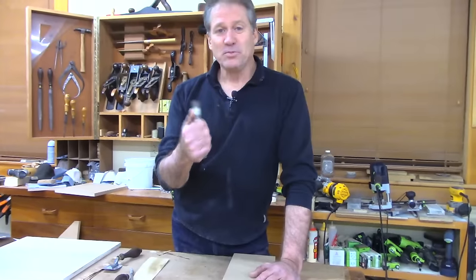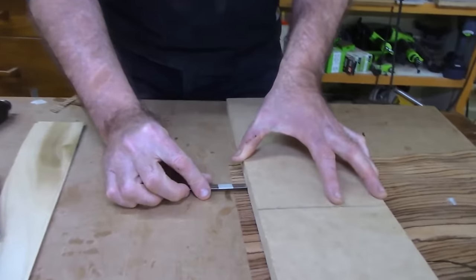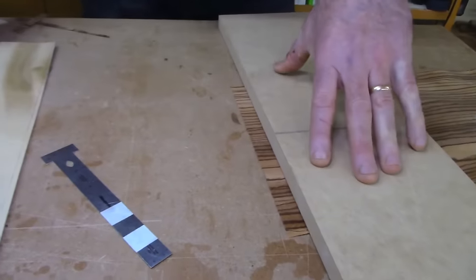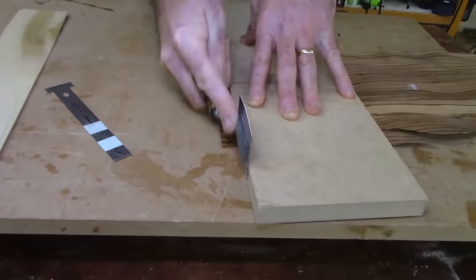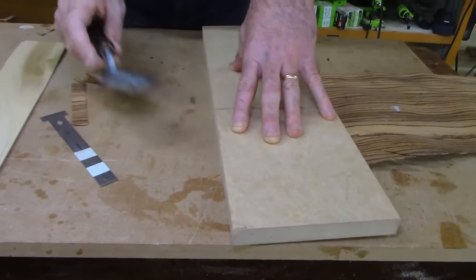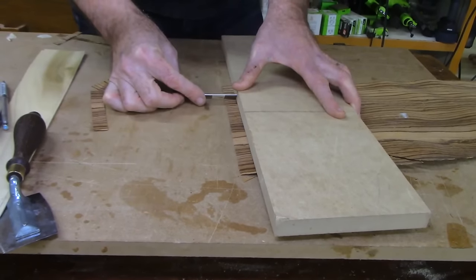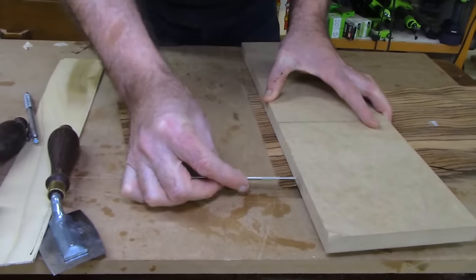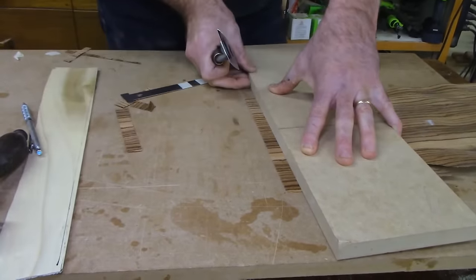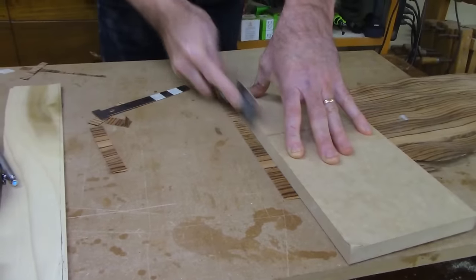One thing I do is put a piece of tape on my rule right at the eleven-sixteenths mark — that way the tape gives me the measurement without marking it out every time. I just set her down to that mark and cut. This veneer is a bit roly-poly and puckered, and where the grain is so short, cutting it can cause fractures — but you can usually just pop it together with a piece of tape. I'll be a little lighter-handed and go backwards here.